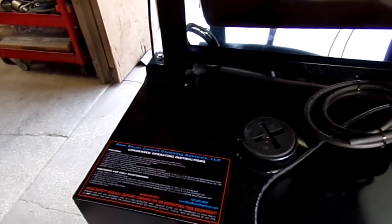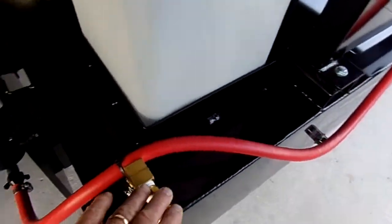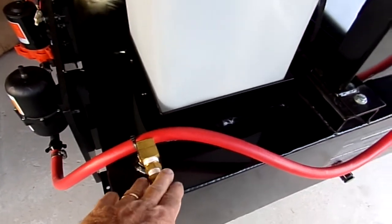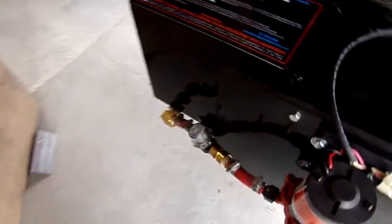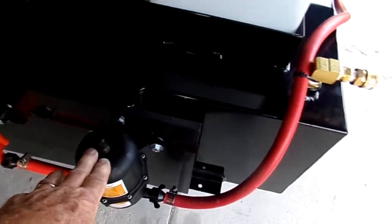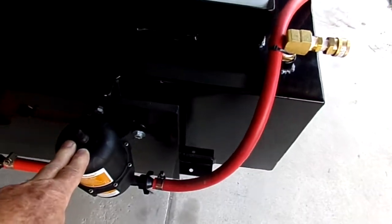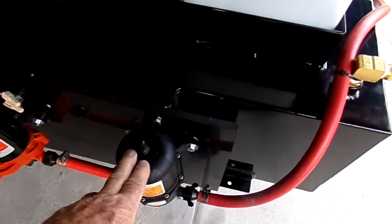It's got a 42-inch in-depth, 12 inches high and 48 inches long. It's got a fill station right here so when you want to fill it up to where you need to, you've got a handy port right there, a drain at the bottom, an inlet on this side, and of course you've got your in-line filter to protect your pump, your demand pump, and your expansion tank, which will give you a consistent pressure without highs and lows in your pressure and pulsations. You want a nice, even flow.